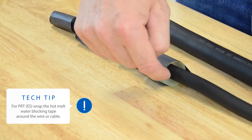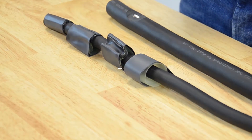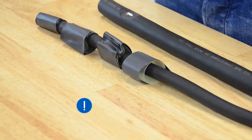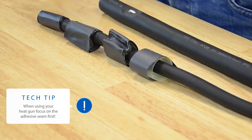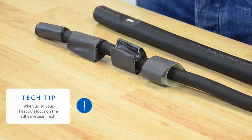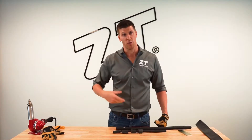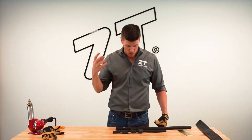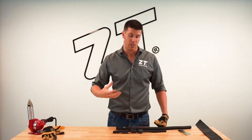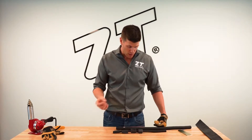We pre-wrapped the actual hot melt so when it shrinks, it heats up and melts. When we start hitting it with the heat gun, we focus on the seam first — we want it fully shrunk and recovered so we don't put additional stress on it later. We also shrink the seam first because it's a thermal and pressure-sensitive adhesive that forms a proper bond once it cools down.